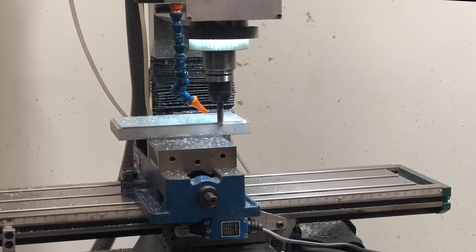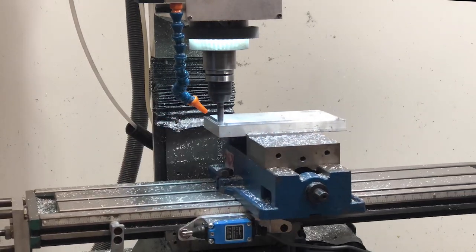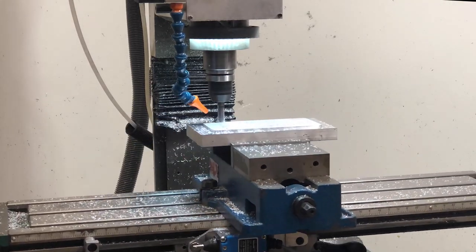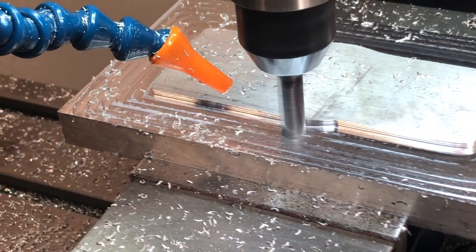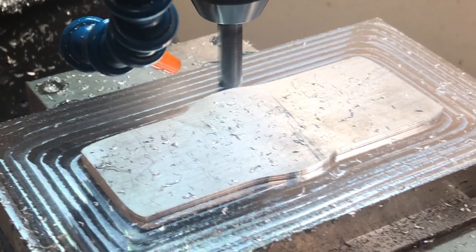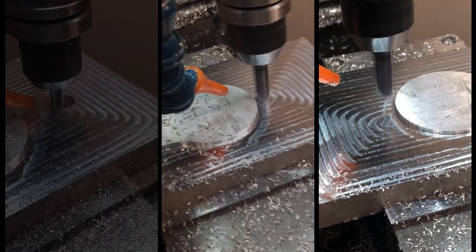So, sometime last summer, I ended up scrapping a part in the mill. I was too confident holding it in a vise with a V-block. It was a piece of round bar. Now, when the going gets tough, the tough decide to sidetrack off of that project and build a whole new work-holding setup. This plate I specifically designed to hold a chuck from the infamous mini-lathes. It's decent enough size for my little milling machine, and I was able to find the dimensions for the mounting flange on Little Machine Shop's website.